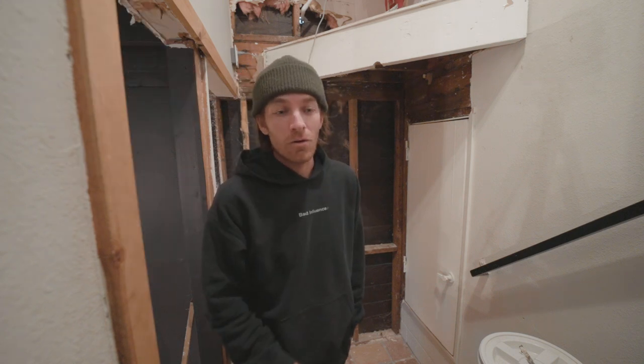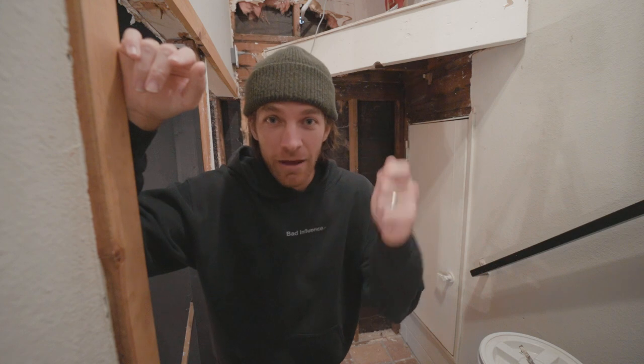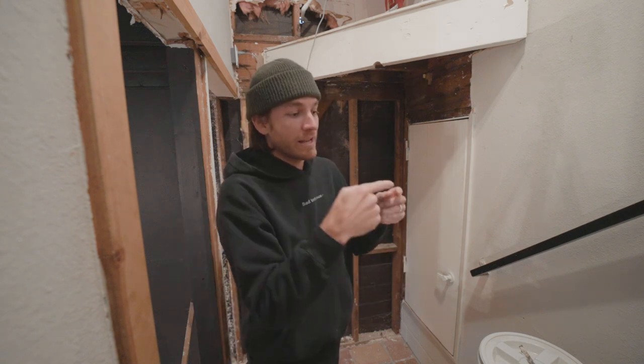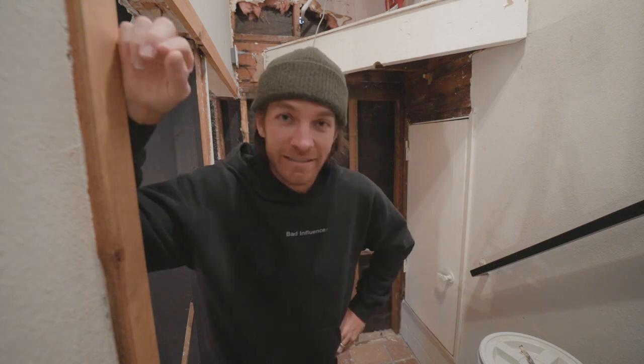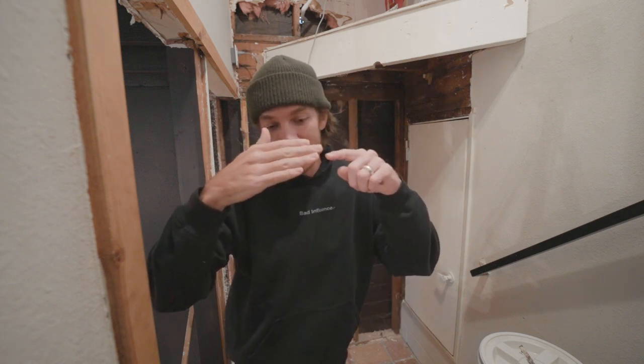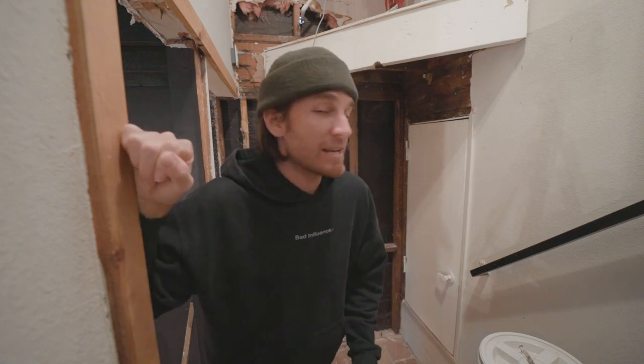A few years ago, we switched out our old, outdated water heater for a new electric water heater. For whatever reason, they have it in this awful spot — this little triangle patch cut out above the stairwell. Super weird. There's a pipe that runs out of your water heater called the condensate pipe — it lets more condensation escape out of the water heater, and you run that through your wall outside, and it just drips. Unless your pipe runs out the wall and instead of being flat or angled down, has a slight upward angle to it. Because if that's the case, your water sits in the pipe, and when it gets to the end of the pipe, it slowly runs backwards, back into your wall — dripping and dripping. A constant, nagging, chronic drip into your wall. This constant drip has just annihilated the inside of this wall.